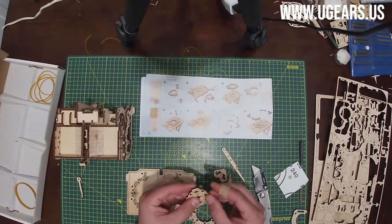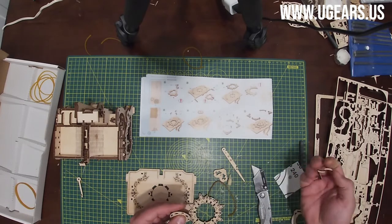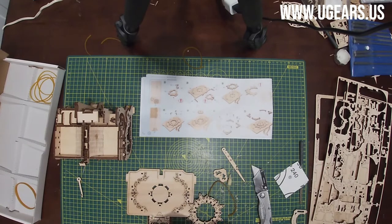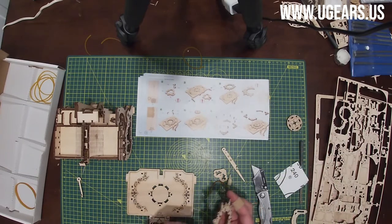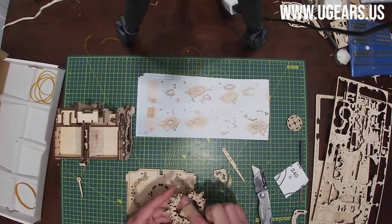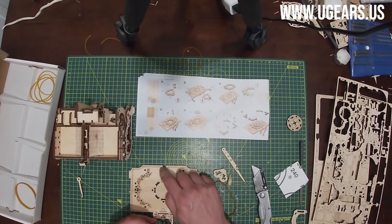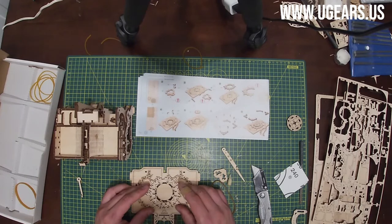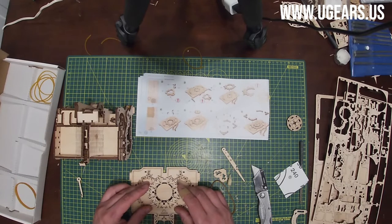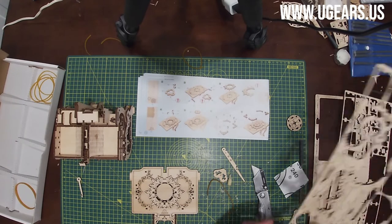And then 68's got these little tabs, you can remove them. That's the little exclamation point there. So we don't need those. So 68's going to be on the side right now. And then part 66 has a little cutout here on one of the sides. So that cutout should face towards the back, towards the cutout right here of the cover. So just set it here, and then step number four is parts number 67 to lock it in place.